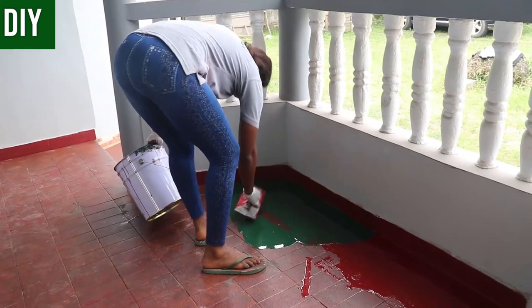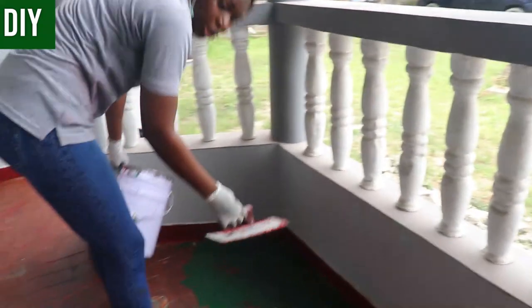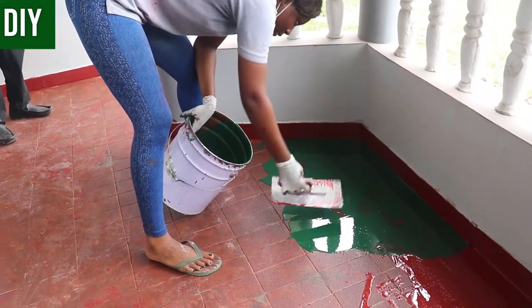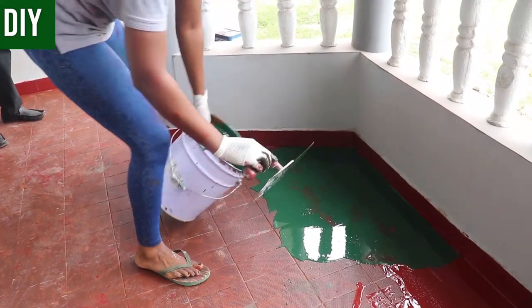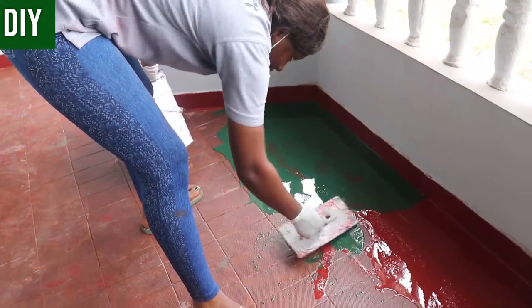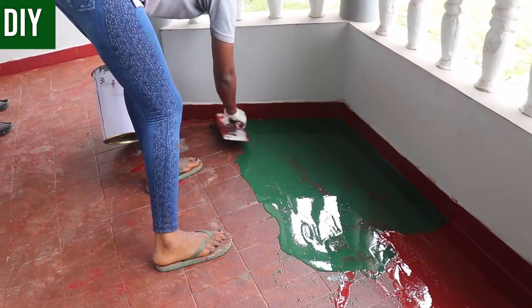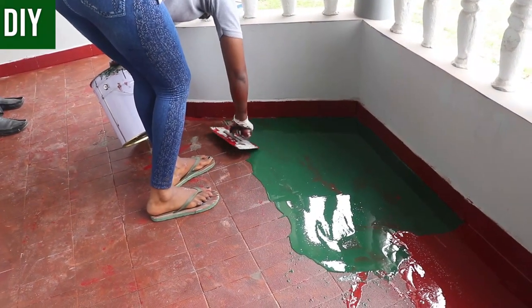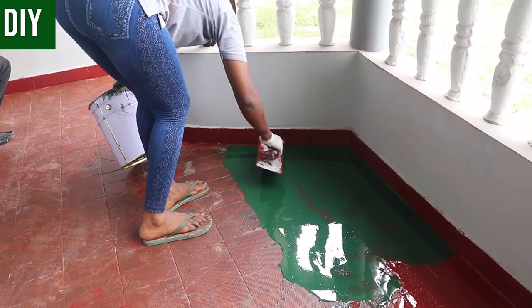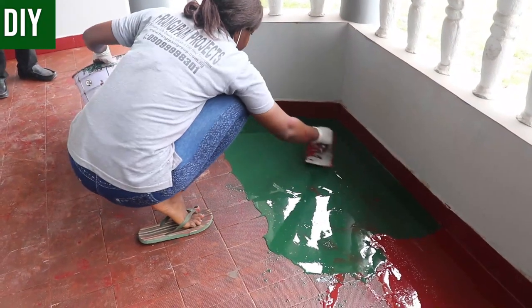For this corridor, we chose a dark background color that will successfully hide any yellowing of the epoxy. Because of the grooves in the tiles, we are adding much more quartz than usual to make sure the grooves are well hidden and properly covered. When preparing the mid coat for SAV, you want to make sure the finish is glossy and smooth like a mirror. Otherwise your vinyl will separate from the floor after a while — there will be no proper bonding between the SAV and your mid coat layer.